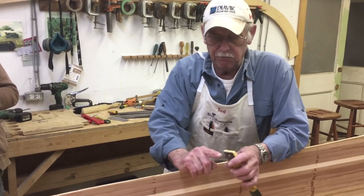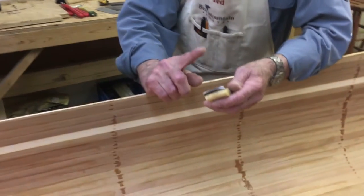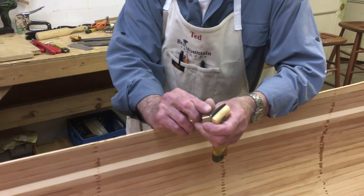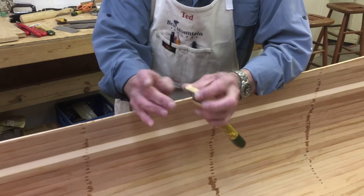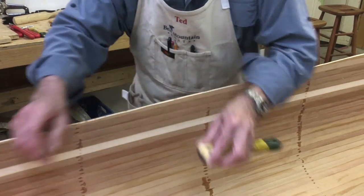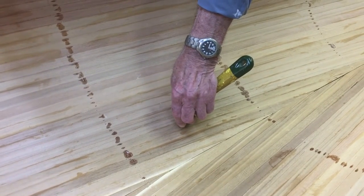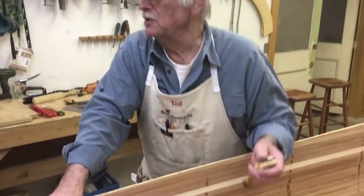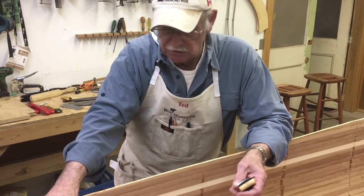So you begin with a straight blade. You'll also notice when you buy them, the straight side has just a little bit of camber to it. Even though it's not very sharp when you use it, the middle of that camber gives you a nice little scraper, so you don't take it back to the store and say it didn't cut. You buy it as a kit the same way you do your cheap plane. So you file it up and it becomes this precision tool.